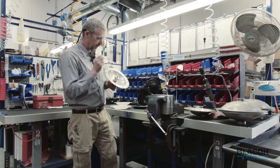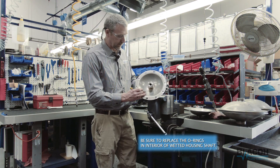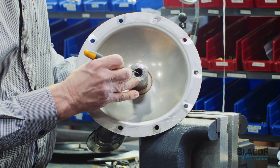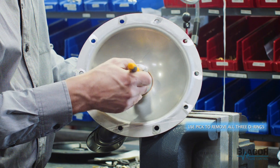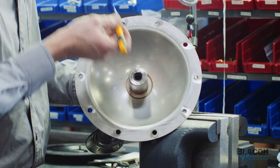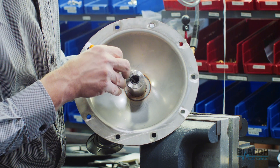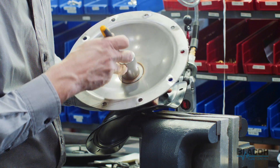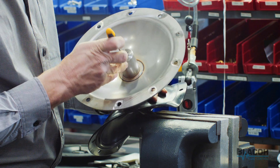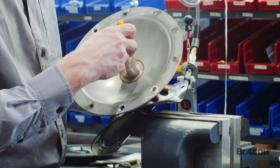When you replace the bladder, you should replace the o-rings. There are three o-rings in here. It's a small hole and the o-rings are fairly deep inside. There's one right at the front — that one's easy to get to. Then there's another gap with no o-ring, and then another groove with an o-ring. Then another groove with no o-ring, and then another o-ring deep inside.